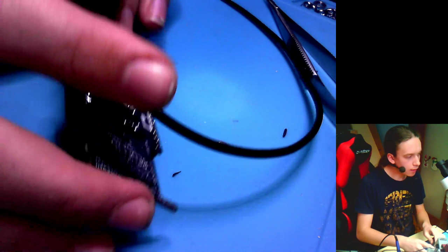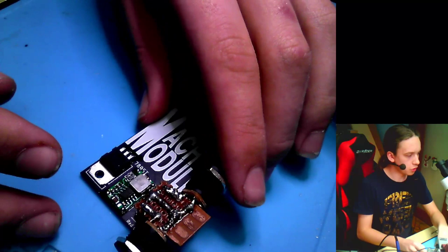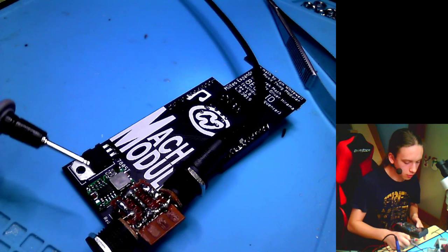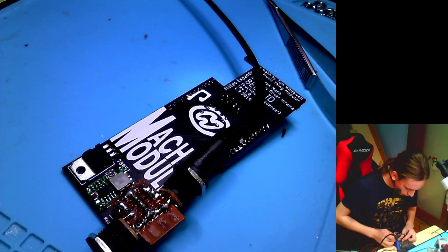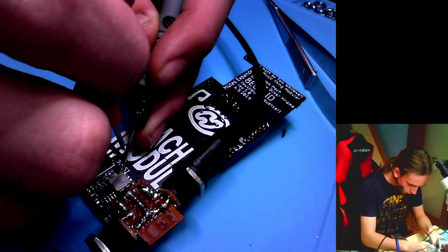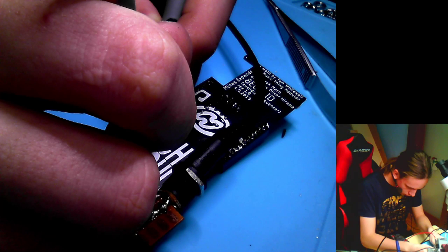And now the last step before you power on this module, I'll try to do it for you, but please check this. There is this converter and you have to set a voltage on it, so set it to 3 volts. So now the output voltage on it is how much? Nothing really. Seems like it's -2 volts. What the heck?